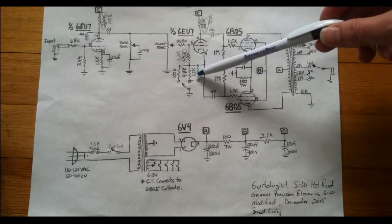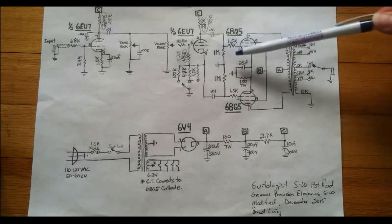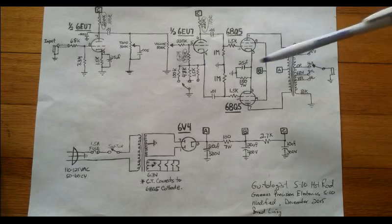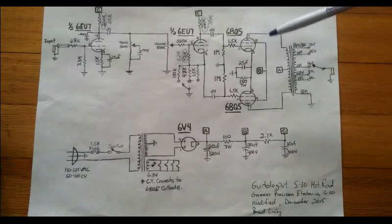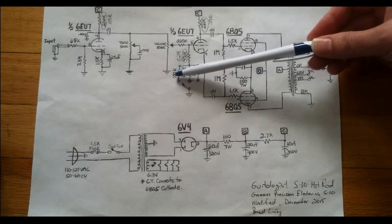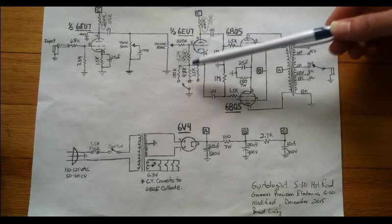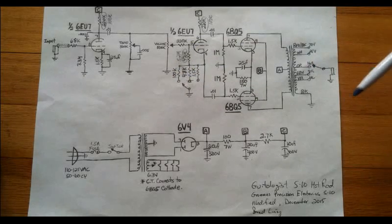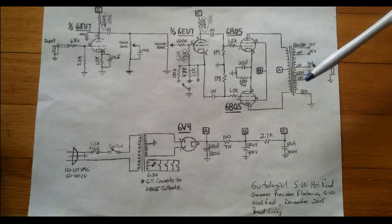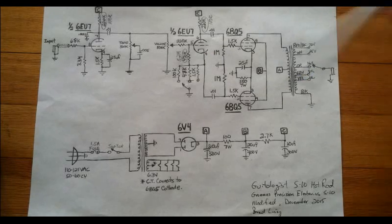This is something interesting. I think what's happening is it's throwing the phase kind of out of balance between the tubes, so one tube is pushing more than the other and it's probably affecting the output waveforms somehow. Not really sure, to be honest. Some of you tech guys might chime in with your theories. The 100K produces what I'm calling clean, the 47K is the normal, and the 1.5K gives us all that fuzz and crunch. With a humbucker at that 1.5K setting, it sounds really amazing.